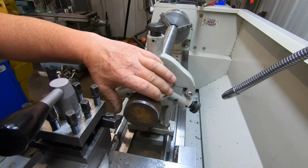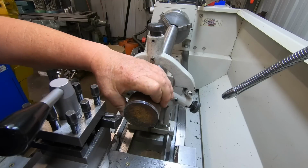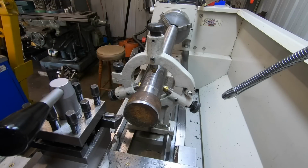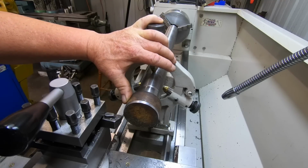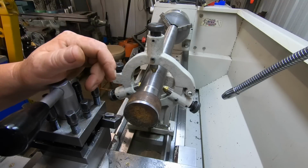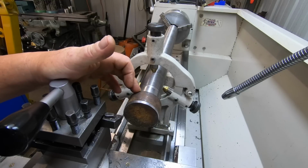So I just want to clean it up, and then I'm going to use that annular cutter I made the arbor for the other day, probably, to cut a hole in that bit of inch plate, and I'm going to see how accurate that is. When I'd done the first hole in that 5/8 plate, it was pretty much smack on from memory. I'll just machine this to suit that hole.